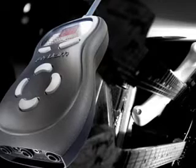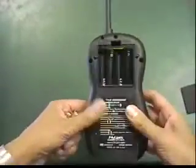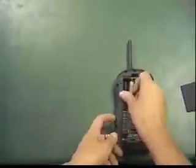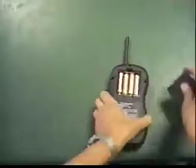First, you'll need four AA batteries correctly inserted into the TX3. Remove the plastic battery cover, then insert the batteries as shown. The positive and negative terminals are indicated inside the battery case. Replace the battery cover and you're ready to use the TX3.